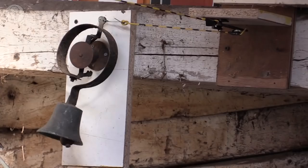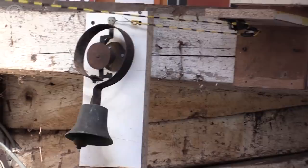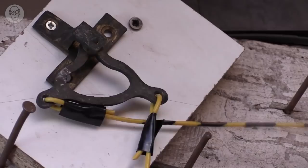I was given some years ago, and so this seemed the perfect excuse to try them out. It took some head-scratching to align the bell cranks to get them to do what I wanted, because if you think about it, all the cables have to be in tension, otherwise it would be very, very heavy. So there's a different sort of linkage that's also widely used in aircraft to reduce the weight.